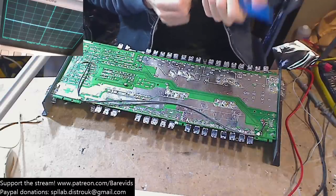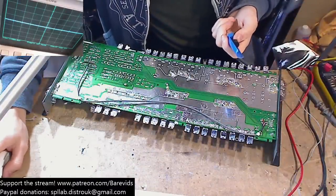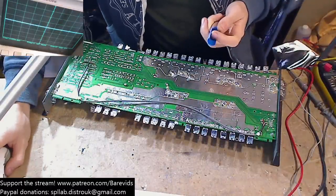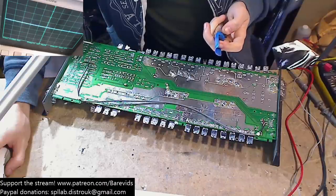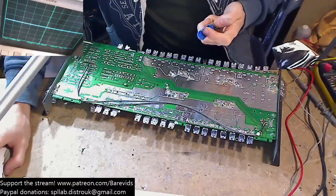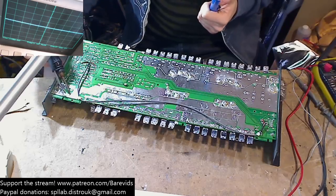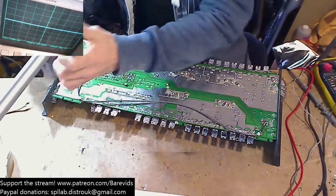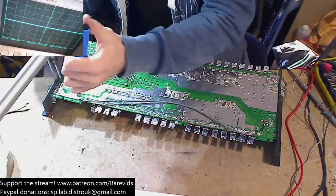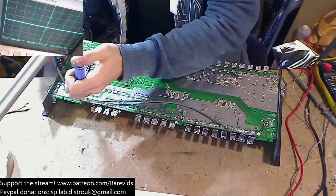The weight is so much lower. Yeah, that is true. The weight of the lithiums is much lower, which is obviously an attraction to those. You think about putting a bunch of Headway 38120 LiFePO4 batteries in parallel and series, capable of 100 amps per battery and only around $16 apiece. I think that you probably need so many of those to be worth it that it would be an extremely expensive way. Yes, they're only $16 each, but once you obtain enough of them to put together something that represents the sort of capacity of a car battery, it's probably going to be quite an expensive adventure for you.